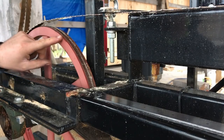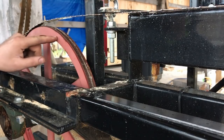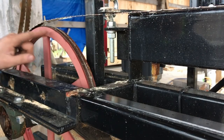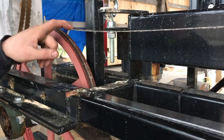You don't really worry about wear inside the V-groove on this pulley, because this belt isn't turning against that V-groove — it's just sitting down in there. I haven't heard of too many people wearing these pulleys out. But I will show you the pulleys that you will wear out. Remember: tension off the blade every night, no petroleum products.